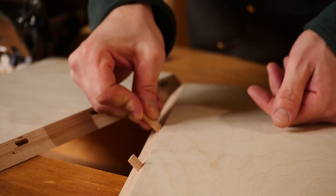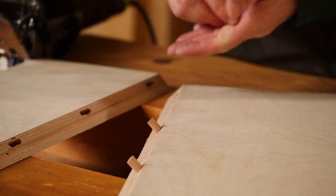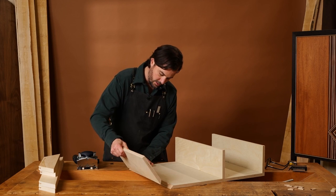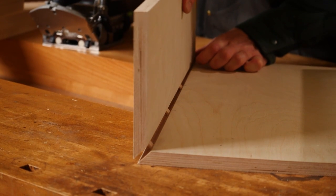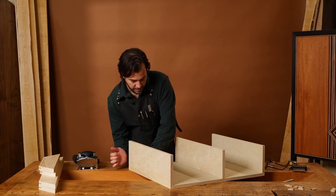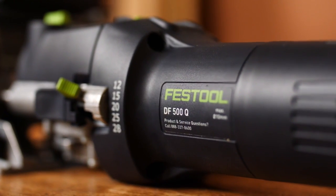When you put the glue, sometimes it's very tight, so you can use a little hammer to push your domino down. Make sure not to knock too hard, because as I showed you earlier, you don't have much panel left on the other side — if you knock too much, you're going to damage the other surface of your project. So here's the domino — it's very tight, that's a good assembly. Et voilà! This is how I use a domino every day in my shop. I use this tool all the time and I love it. I hope you're going to get yours. My name is David — see you soon.